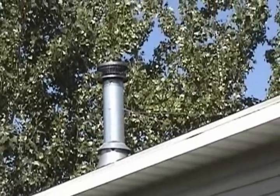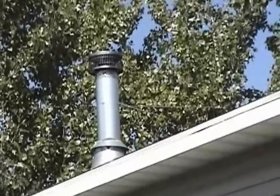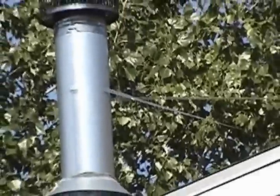Let me show you the outside of the chimney on the roof. I've got about four feet coming out of the roof — it's a pretty flat pitch. You can also see I've strapped the chimney since we get wind occasionally, so it's good to have it secured. That's what the storm collar looks like, sealed up with silicone — that's what it looks like on your roof.